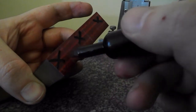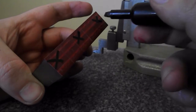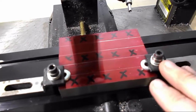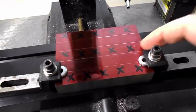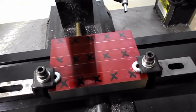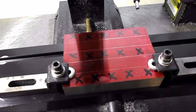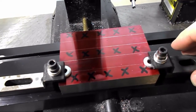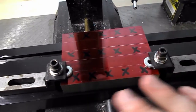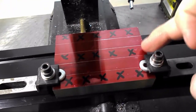So this center square essentially will be cut away, and this square. This is the setup for milling these two sections away. I can't do all three just because of the placement of the slots — I don't really have a way to clamp it. I could make a tooling plate, but I'm going to do it this way. The first thing to do, now that I have it semi-clamped, is to indicate it straight, and then I'm going to start roughing the back section and the middle section.